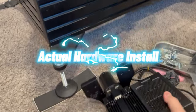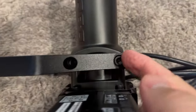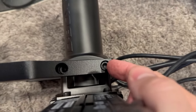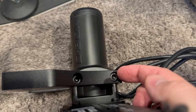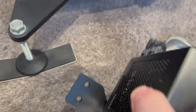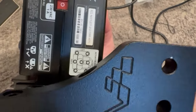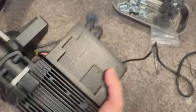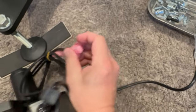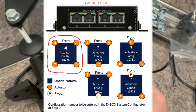I have the ASR brackets here. Very easy, simple design with M5 bolts. You need two wrenches — M5 and M6 — and I'd add blue thread locker to these. These are not really labeled, but they're all the same actuator so it doesn't matter which is left or right for the physical mount. However, when you go to plug them up with the RJ45 data cable into the control box, that's very important to get correct — it has instructions.